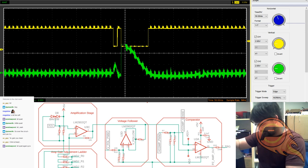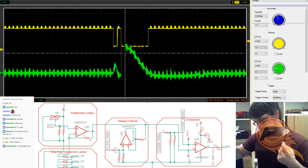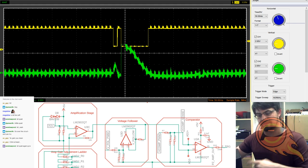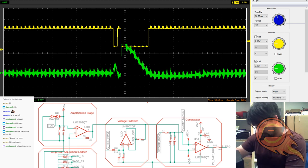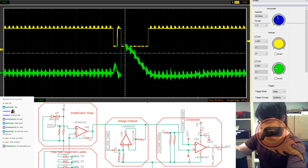And the buttons that are currently there are also what are poking those piezo discs. I need to fix that, because again, the actuation is uncertain with those, so it's not giving me the kind of consistency I want. It's still coming in at about 0.12 millimeters of repeatability, which is much higher than I want. So I'm gonna just go and print some cones or something that'll poke those discs from the bottom when the bed leveling goes through.